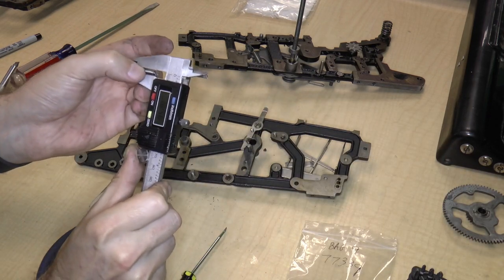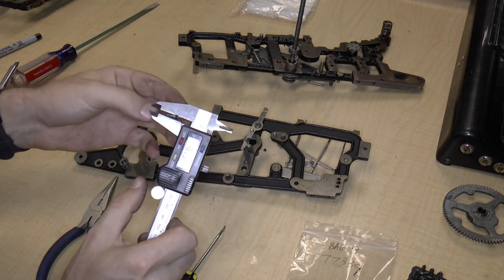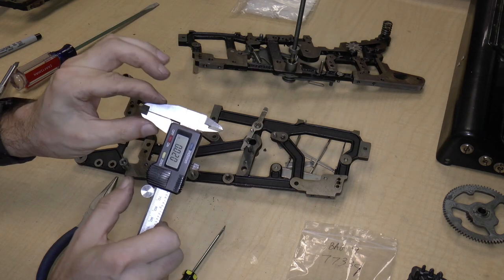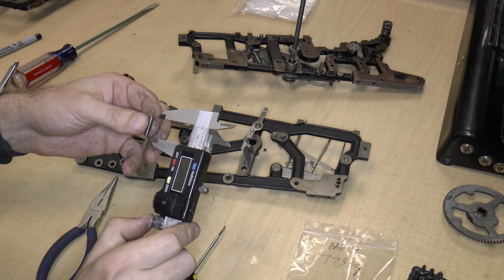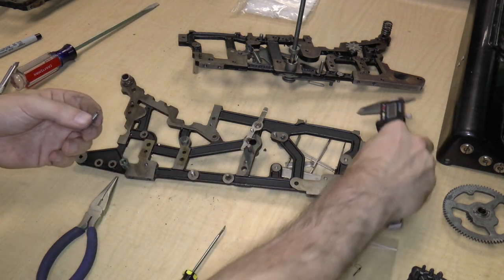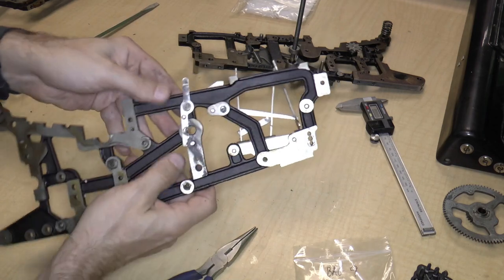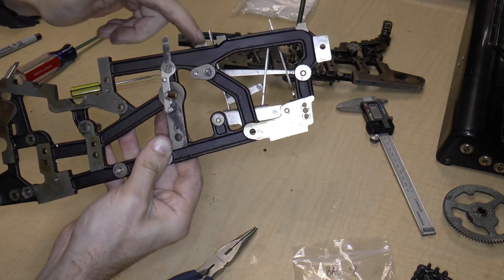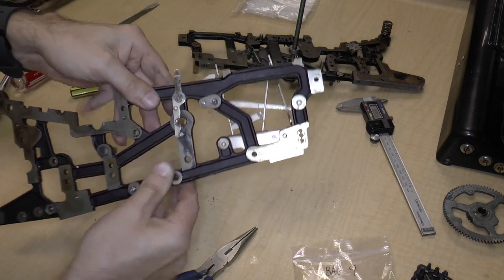I will measure its outer diameter, which is .152. Measure its wire thickness: .019. And I'm going to measure its length — it looks like it's about .71 or so. That way if there's another spring I can differentiate the two. So now we have this lever. Is there a nut on the other side? No, it's just a screw. And because it's pretty loose, that probably means there's going to be one of those washers with a little shoulder on it that this lever can sit on.